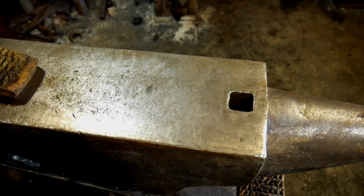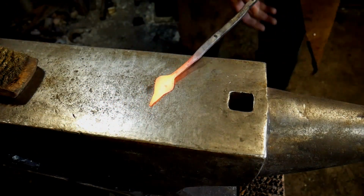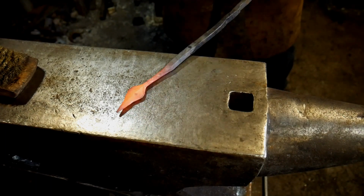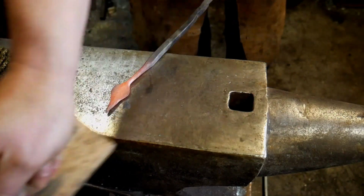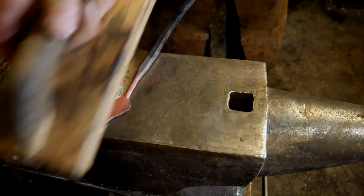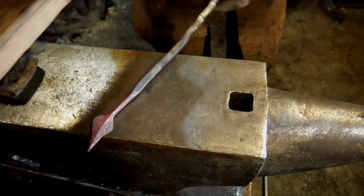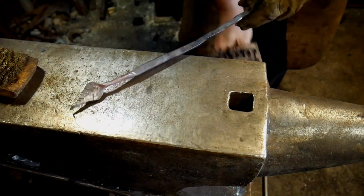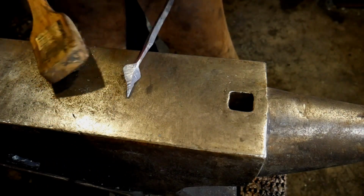So the first thing on this is temperature. You don't want to be brass brushing at this heat. This is a bright red, really dull orange heat. This is where you want to clean the material of any forging scale, and get it so it won't rescale on you, and this will help it get just a wee bit of sheen to it, just a little bit of a sheen. You see that there? That's going to help the brass pop.